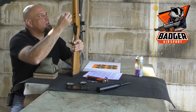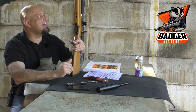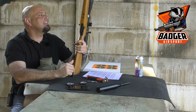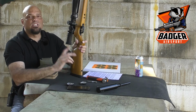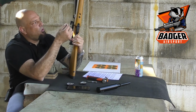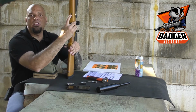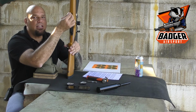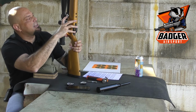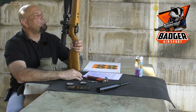Just take a screwdriver and wiggle it a little bit, and that leak will immediately subside, and you can continue filling that specific regulator, or cylinder for that matter. So what happens next is, you can make small adjustments by turning this regulator screw anti-clockwise, and as you turn that, you'll notice that it will increase the pressure on your regulator.